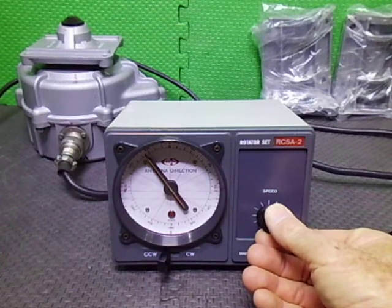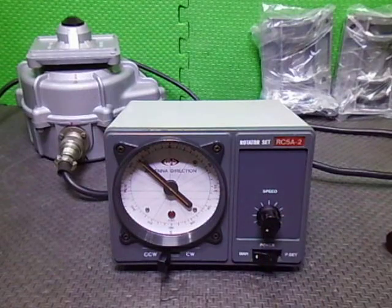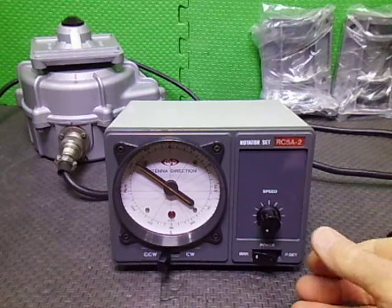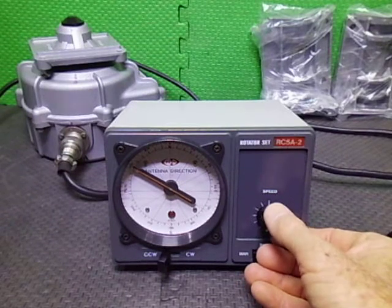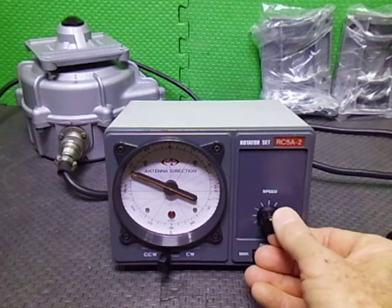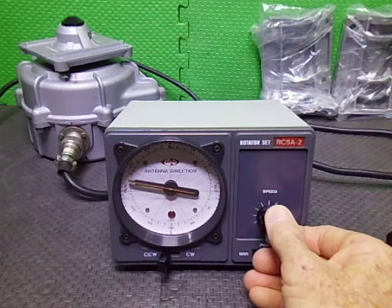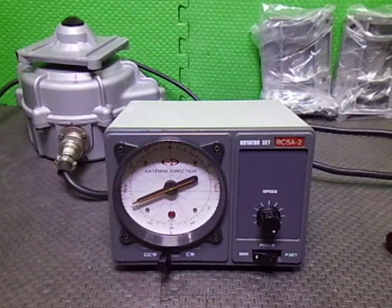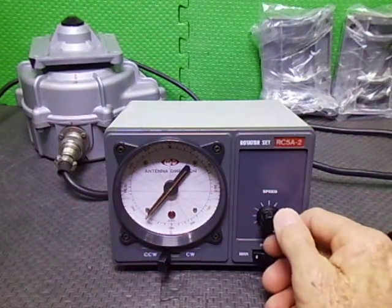There we go, and then we can do the speed control — down to a fairly low movement. You probably can't even hardly see it moving, but if you look closely you can see it moving. So they get down quite low. These later boards do go slightly slower in their speed control. So we're just spinning back up again — and this is an AC motor, a 28 volt AC motor, and this is a pulse drive by a triac or SCR.